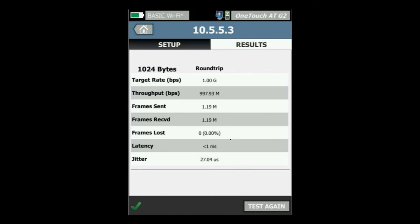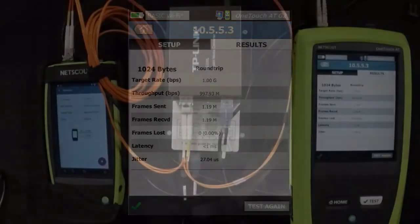I know I'm not putting a failure point into the network by putting that tap in. So what do we get out of this? I know that when I put this equipment in my bag it is going to work. I know that when I put it into my client's network, I am not putting something in that's going to slow down their network. I know the SFPs are working properly, the fiber patches are working properly, the copper works, and the tap works. This is why we want to test this equipment prior to taking it out in the field — we want to know our test equipment is working exactly as it should. Thank you for watching this video, I hope you found this information useful.